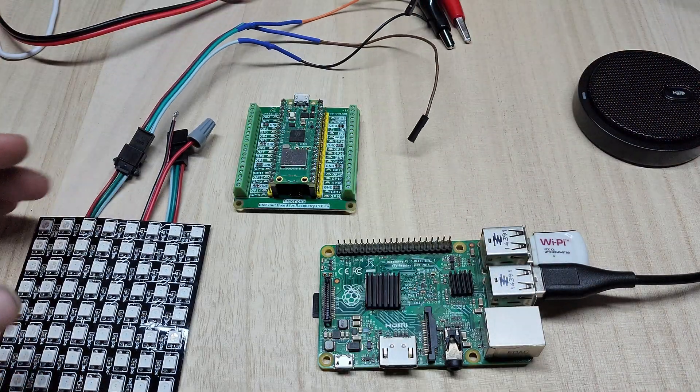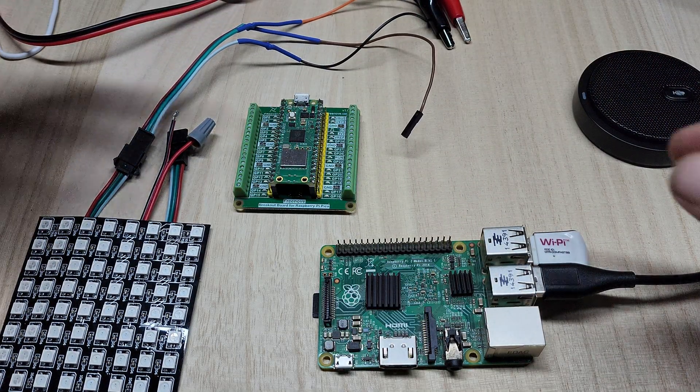So here I am back at square one. I could abandon the LEDs — they're not that useful on the mini really — but I won't give up that easy. In tireless pursuit of independence from third-party services, I'm going to enlist the help of this Raspberry Pi Pico to serve as the LED controller. I'll connect it to the 3B with UART so I can send data to be displayed using a direct connection. Clever!